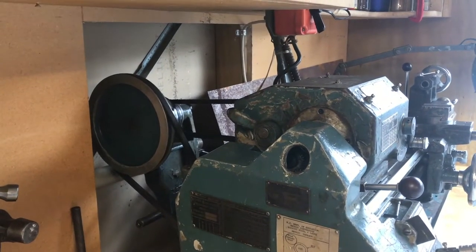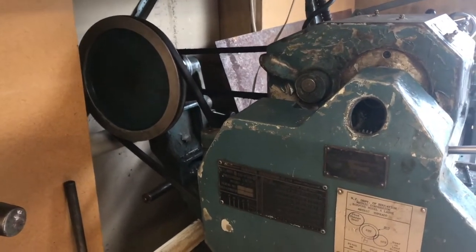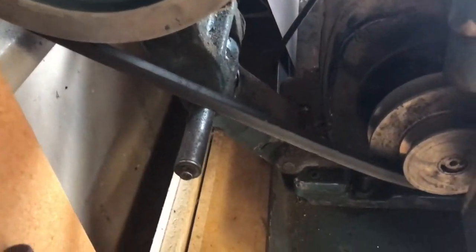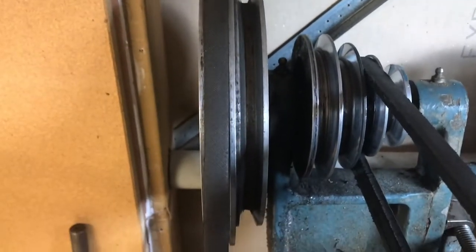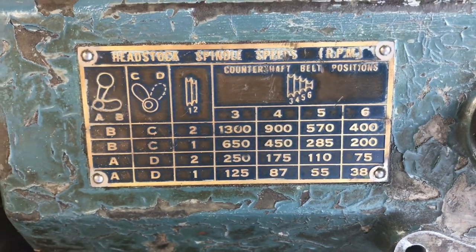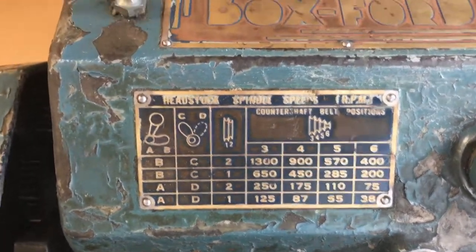For anyone who might be a raw beginner with lathes, or particularly this particular model, I'd like to give you a rundown of what all the different knobs and levers do. We'll start with the motor, which on this lathe is located right down the bottom. It partly uses the weight of the motor itself to provide tension on the big wheel. You've got two pulleys you can change positions to alter the speed of the main spindle driving the chuck. There's a table on the front showing how many RPM it will do depending on which pulley positions you've selected.